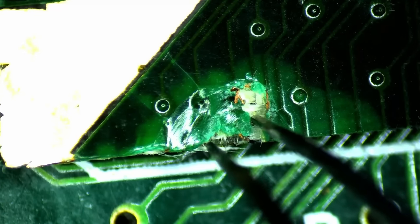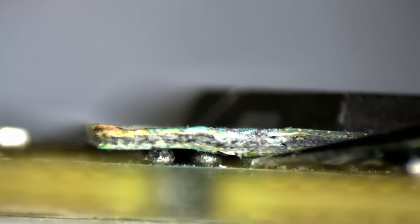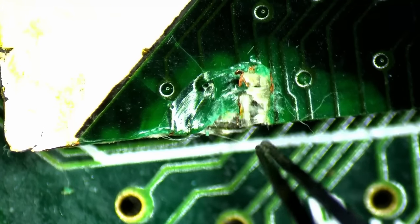Unfortunately, the bottom left corner looks a lot worse. This is the result of a careless, quick and mindless action — the PCB cracked through all layers. Luckily, this seems to be a simple substrate with just one top and one bottom layer. Now I don't want to get ahead of myself, so before I remove the chip, I will try to repair it from the top. As you have hopefully read in the title, this is my first attempt at fixing a BGA chip, so any advice or tips are welcome. Please do not use my approach as a guide on how to do this correctly — I am not an expert and I am still learning.